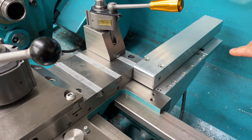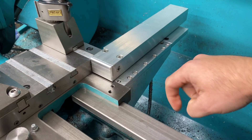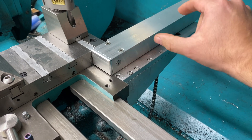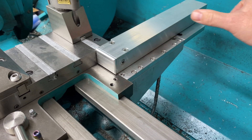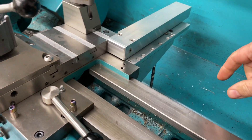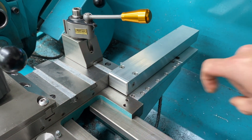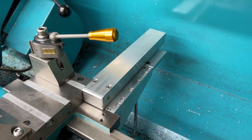In the previous video I showed how I'd fabricated this bracket. Since then I've extended it — I've added about another 75mm on the back so that I could move the reader a little bit further back, just so the scale was a bit better supported. After that I made a new bracket to mount the scale, which is this end piece here, and then there's a cover I've made from an aluminium channel.